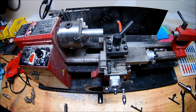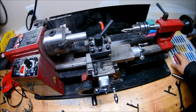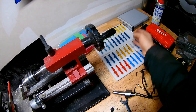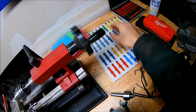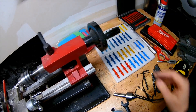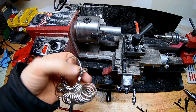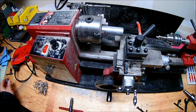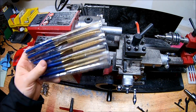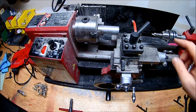Before we get too far, let me show you some of the tools I'll be using. I'll be using a chuck that will go in the end here so I can drill my holes. I'll also be using a set of carbide tip bits — I know this is soft aluminum and probably a bit overkill, but when in doubt, go big. I've got a set of longer boring ones as well. I'll put a link in the description below so you guys can check those out. I also have a ring sizer and a set of actual ring sizes so I know how big to make my arbor. I'm also going to use a series of sandpapers and diamond tip files, and also this center bore bit.